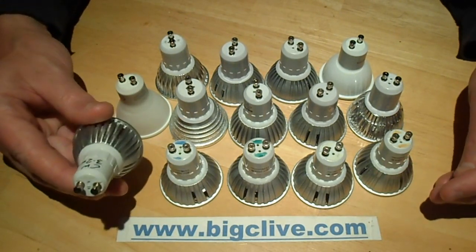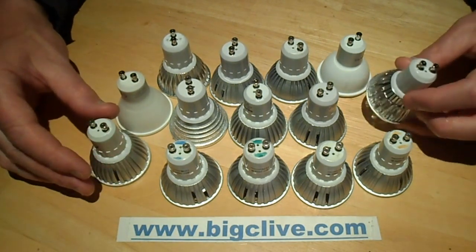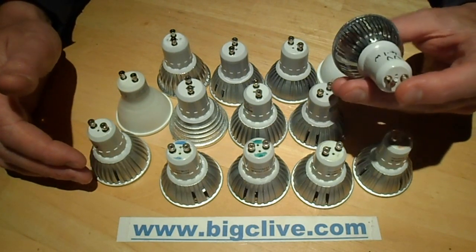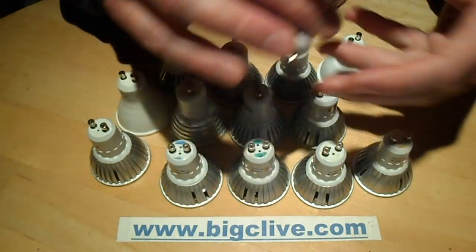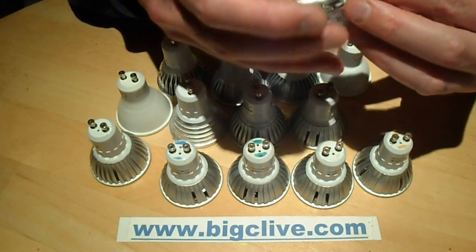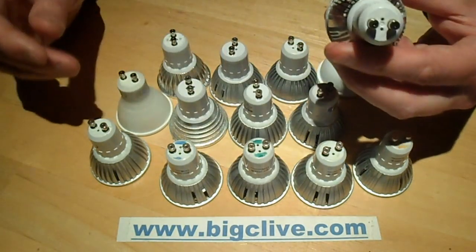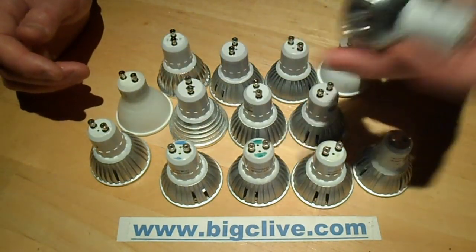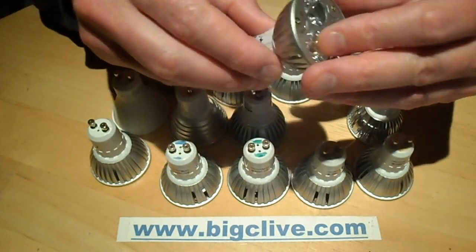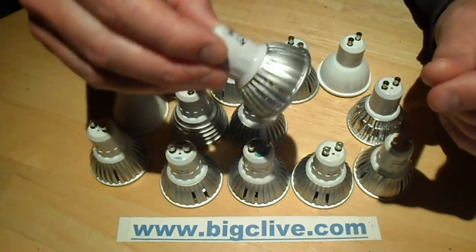There's a recent lamp, cold white, rated 3W, and it comes out at 3.2W, so that's pretty accurate. Next is a lamp described as a 3W ultraviolet lamp with 3 ultraviolet chips. It has a deeper, fluted casing than the others with a lot more airflow through it — but this one actually came out at 4.1W, so it's a wee bit higher than rated online. Then there's one classed as a 4W warm white — I'm guessing maybe they're just pushing the chip a bit harder, or using a different chip — and this one also came out at 4.1W.